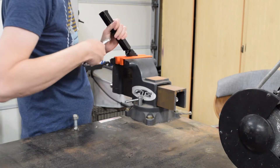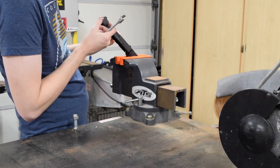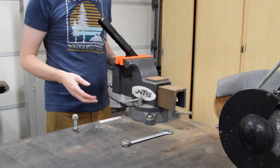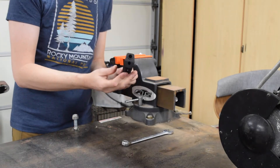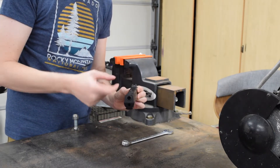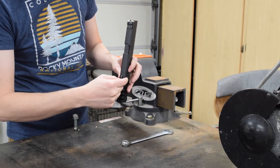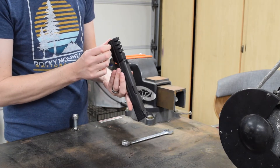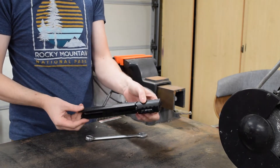I'm going to crank it into position and visually eyeball it. That's actually exactly where it needs to be — it didn't take a lot, about 20 degrees of motion, and now that is locked into place. What I'm looking at is whether the center line is matched up with the front sight post, equal spacing on the right and left, and equal light on both sides of the gap. That is the actual installation of the compensator to the barrel.